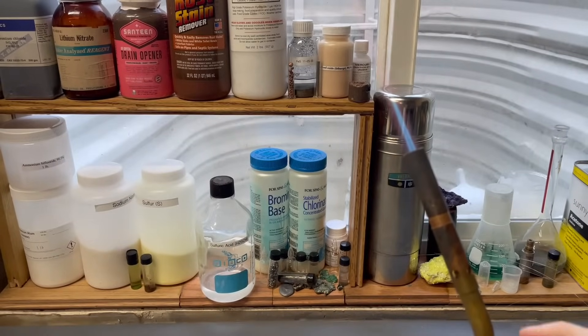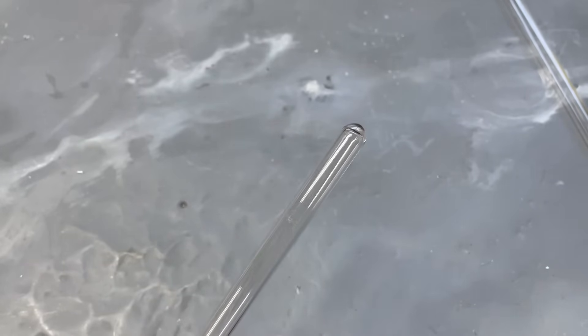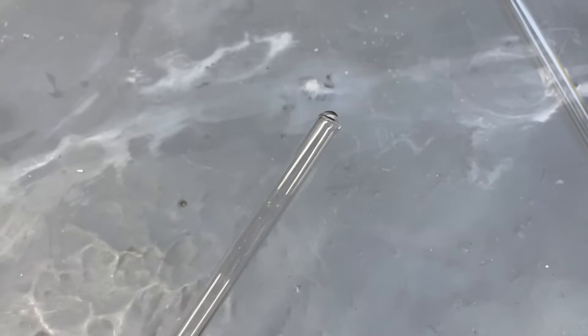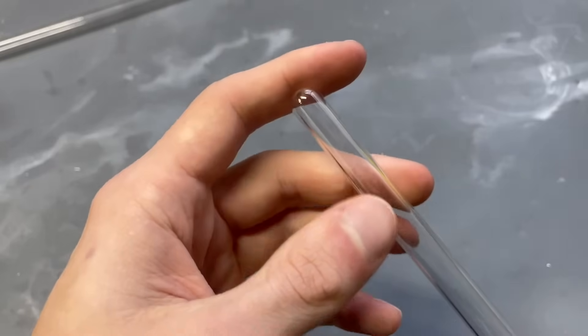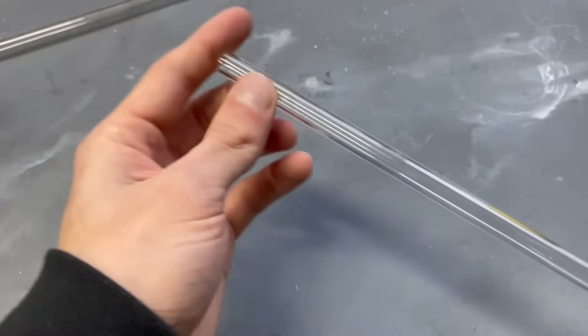Now we're going to set this off and let it cool. Here's what we've made — you can see there's some glass that has beaded up unevenly on one side, which isn't ideal, but it's hard to maneuver around the camera. You can mitigate this problem by removing more glass, heating it more evenly, and pushing more air into it — it's all about experimentation to get it into the nice test tube shape. Here's an earlier one I made which has a nice round and even glass distribution throughout, which makes a nice test tube or the end of an ampoule.